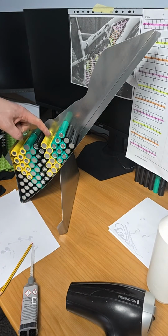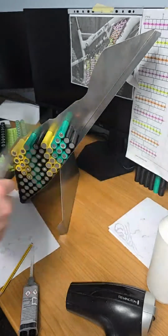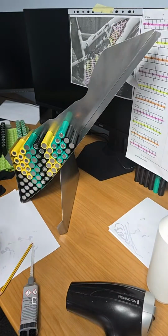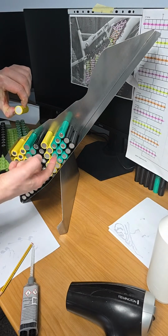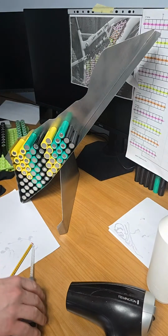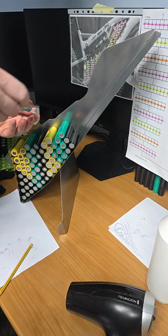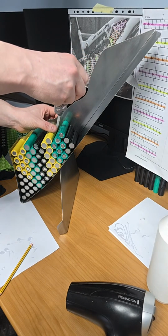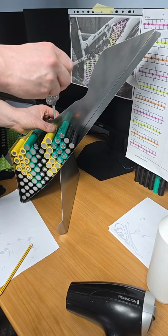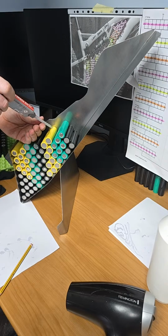So what I'm going to do now is move on to this one, which is a yellow cell. That corresponds to the drawing. I think a string, it was 1, 2, 3, 4, 5. Negative pole facing out, making sure that the cells underneath are glued at both sides. So I'm going to glue the awkward side this time. Rather than try and place the nozzle in, I'm going to do it to make life easy for myself. I'm just going to put the bead on here and run it down the hill.